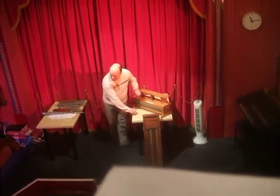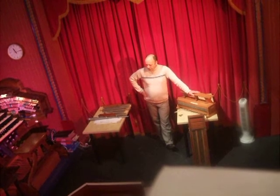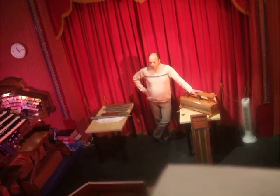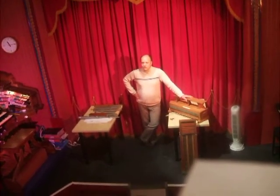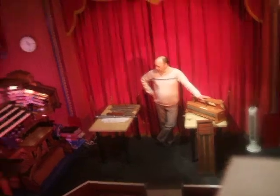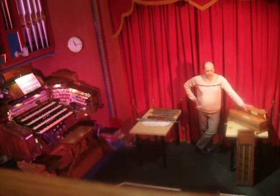When you say a relay, it's sort of low voltage. The organ works on 12 volts DC. Everything runs off the mains. Well, historically, it used to run on a large dynamo. If any of you have bicycles, the dynamo on the back wheel gives your lights power. You'll realise that the faster you go, the higher the voltage. In the case of the pipe organ, the original dynamos were driven by the blowers running at constant speed, so you were guaranteed to get approximately 12 volts out.